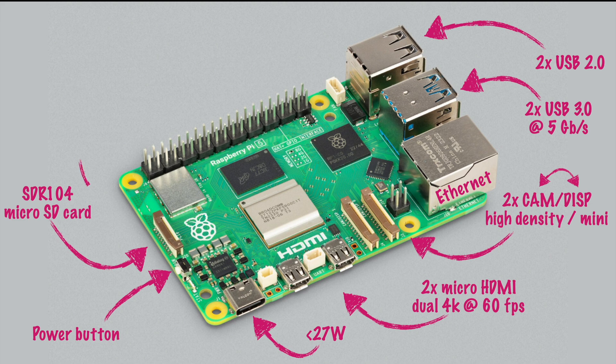Another first for the Pi is this PCIe slot, where you can plug in any type of extension. We're already seeing the first default extensions from Raspberry Pi themselves, and I expect the aftermarket will come up with a lot of extension boards capitalizing on this PCIe port. Before, you had to use your 40-pin header to connect any kind of extension, blocking pins you may need for other peripherals like sensors. Having the PCIe port for extension boards is definitely a gain, while still keeping the flexibility of the 40-pin header.